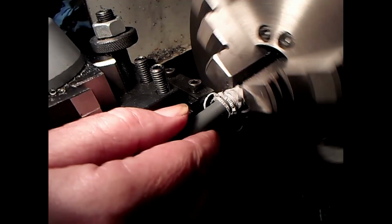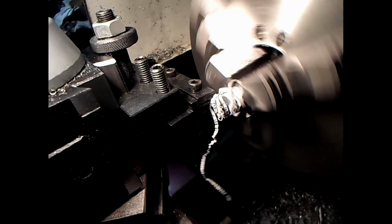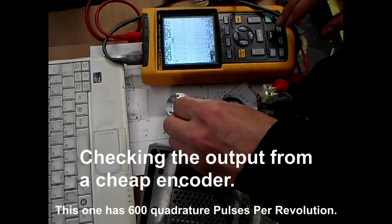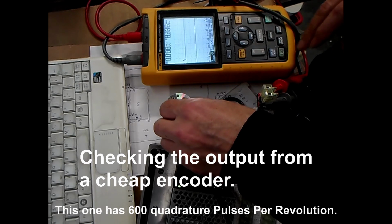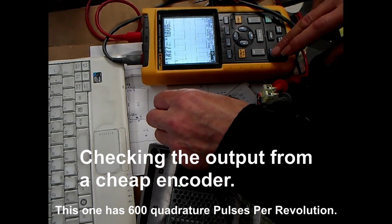It turned out that the controller, by default, had a parameter box ticked so that when a G-code program was run, the spindle is automatically powered on. Changing this would have been a quick fix, but I left it as it was.